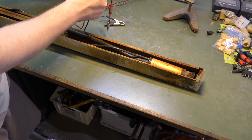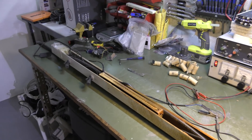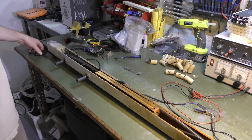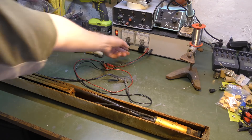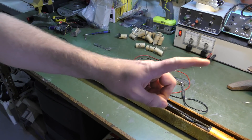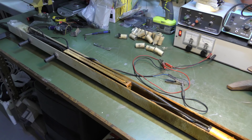I measured the battery and it was 12-point-something, so that should be good, but I want to try powering it from my power supply. Let's make 12–13 volts here. I put a switch on it. It actually looks like something is short-circuited — I don't think this is moving. Looking at the power supply amp meter, when I move the leads, the amp meter moves ever so slightly. That tells me the circuit is actually working but the motor is not running at all.